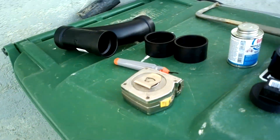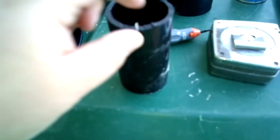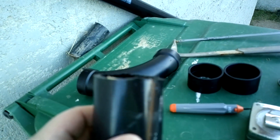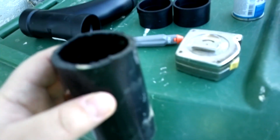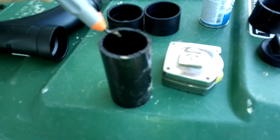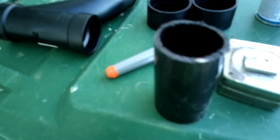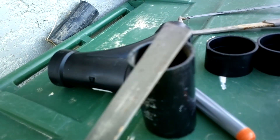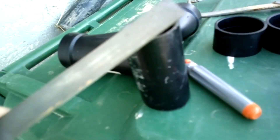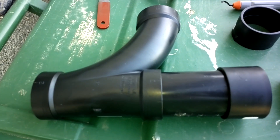Now back over to this side here. I should do a little tutorial about gluing. I did a little rough job of cutting that — see how level that is? Just kidding. This side — level. It's not perfectly level, but it will probably do fine. Now I'm going to take this reamer here, go on the inside, run around a few times, do it on both sides. Also what I can do is take this file and get a little rubbing around the side — use both hands though. I'm going to bevel the outer side just a little bit on the tip there, on the top edge, with this smooth file.